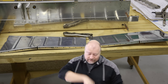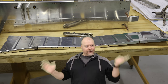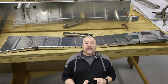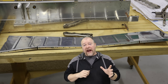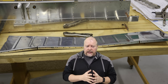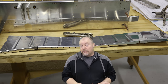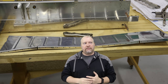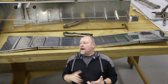Someone came into the hangar - that happens a lot, people just open the door and walk in. Nice folks - the aviation community is amazing. I asked Vans specifically if they had a plan of where on the part to flute to get the correct results. They were not able to provide that, which makes sense - every one of those ribs is slightly different due to the nature of the stamping process and imperfections in the aluminum. If you put all of them on a table they each have a slightly different bend, so they can't provide an exact schematic. That's the best they could do.